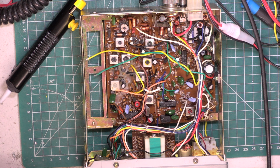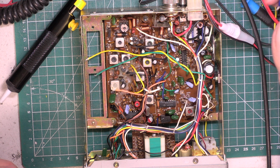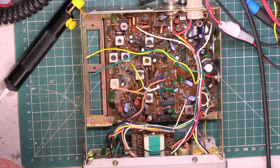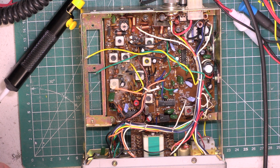It was a bit of a boo-boo, and had anyone complained, Plustronics would have had to do something to provide 4 watts. I think there was some optional external attenuator, which it could have offered for free, because it was a mistake. It was a legal requirement to provide low power, and the deal was that if your aerial was mounted higher than 7 meters from local ground level, then you were to attenuate your transmit signal by 10 dB, so you became 0.4 of a watt. I'm not quite sure how many people did that. They rescinded that about 6 years later.